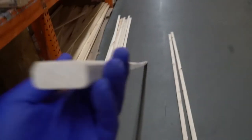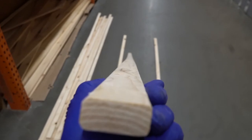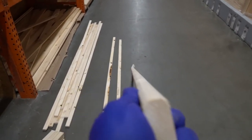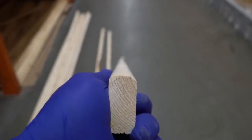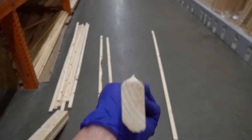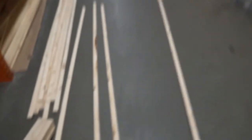If you're buying just a few pieces, you really have to select them. This would be considered a pretty good piece — just a little curve on the side. In the good pile. This is not quite as good; see that curve at the end? You will probably end up cutting it off — that goes in the maybe pile. And this piece is pretty bad; we can't use it, that goes into the bad section. This one is good. Good enough for government, as they say.